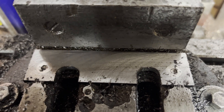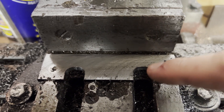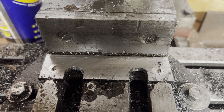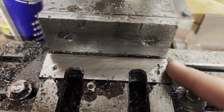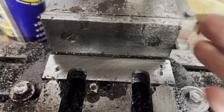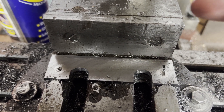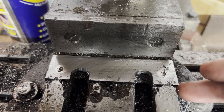Quick check - I forgot to hit record. We've milled out these. You can see this one appears to be slightly smaller than that, but it's only 10 thousandths, so it's not enough to matter. The ends have been machined flush with this back casting. Not only is it next to this, but I can't get a milling cutter in there, so it's off this back step over here and some over there, so it's slightly wider.